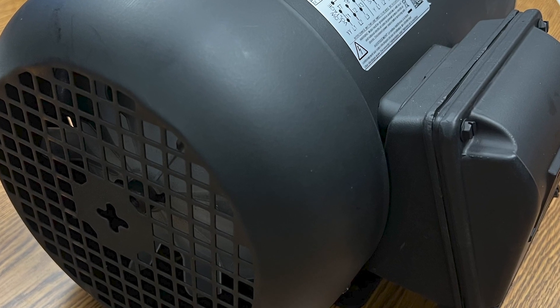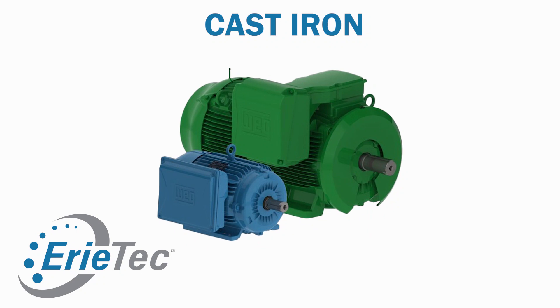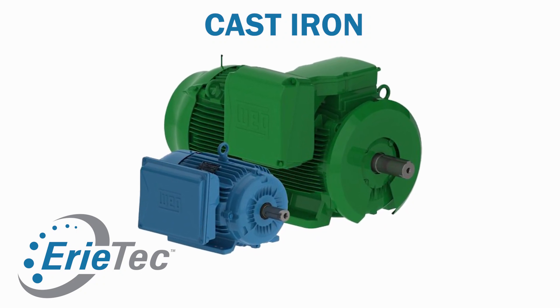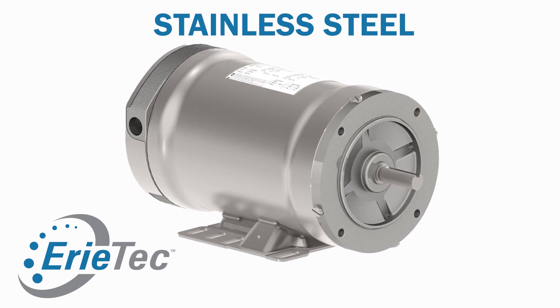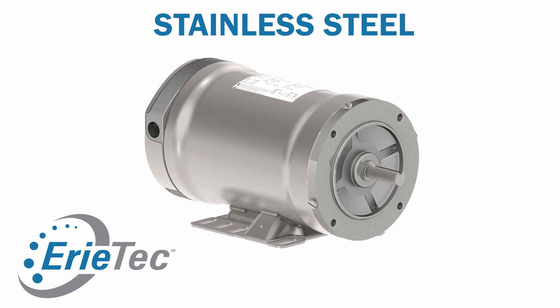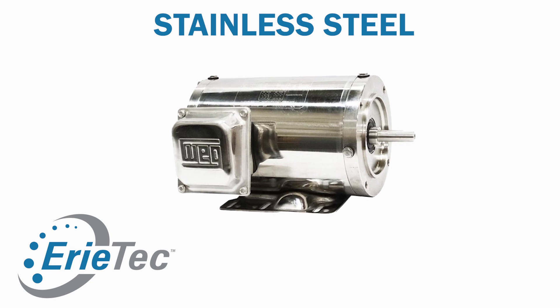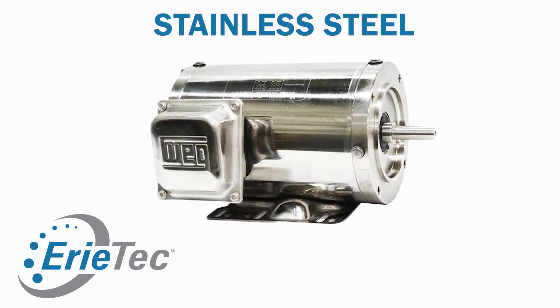Another consideration is the construction. Our example here is rolled steel. It won't dissipate heat as well as cast iron, but it weighs a lot less. In some cases, if you have high humidity or corrosive gases, you would also need a stainless steel motor, which normally will have a round body like this as well. If you're going to be around food grade applications, that's another discussion entirely, because you may need stainless steel or something painted with an epoxy.